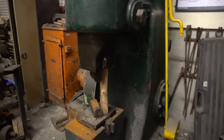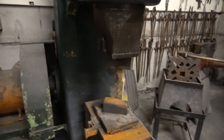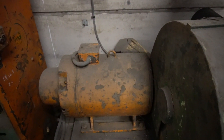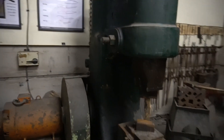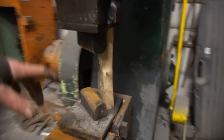The bigger power hammer has a lot more tooling. It's still broken — I haven't gotten around to fixing the electrics yet. I was at the motor place last week when I picked up the electric motor foot for the other power hammer, and got talking about fixing Frankenstein. The motor rewind specialist thought he'd be able to make me a new controller, or certainly something that would turn this motor on and off. Unfortunately the big power hammer has a slip ring motor and they don't really make those anymore — or they do, but on things like wind turbines which are millions of pounds. The advantage of the slip ring motor is it's better for starting big hammers because it controls the torque and speed, but unfortunately it's not working.